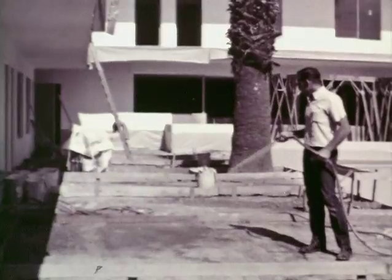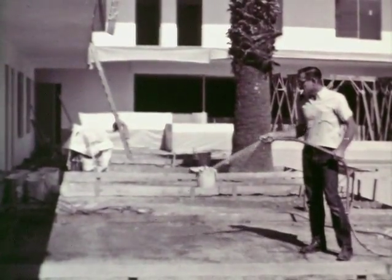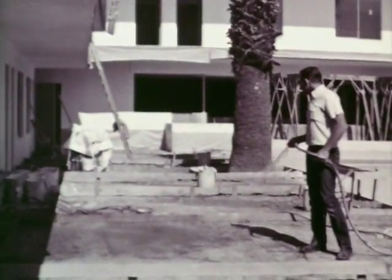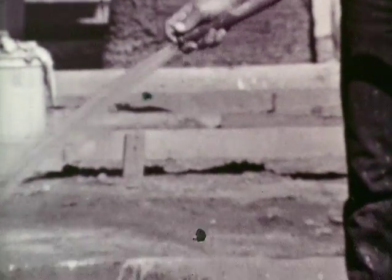Sandy soil is best for Kool Deck. Clay soil should be covered with a 2-inch layer of sand to prevent uneven suction of soil to concrete. Wet thoroughly the evening before the pour or early the same morning. Don't wash off coping protection.